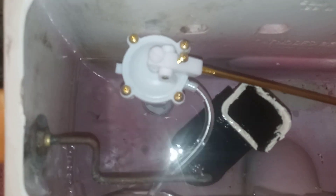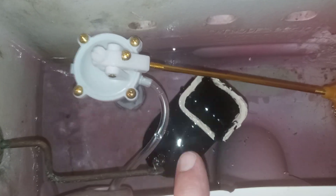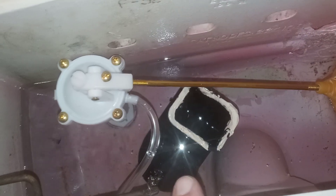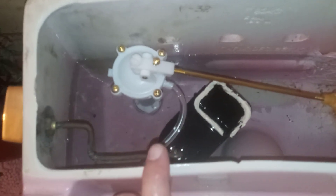In a last-case scenario, if that's the way you want to go, you can do this. It's also a good option if you start having trouble with the flush assembly on the old valve — like the ball wanting to stick open or having to hold the handle to flush. You can convert to this new style, and you don't have to trash your old toilet. This works with the Pompton as well as the Rochelle.